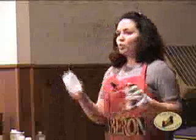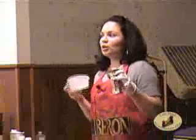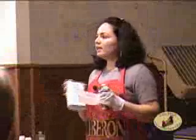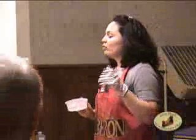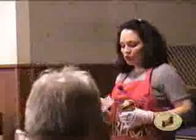What I have here, which is what this article is about, is a product called finishing oil. This is the one thing I'm going to mention straight about later on: there's pure tung oil, and that's all fine, and all tung oil is a 24-hour dry time. This product is tung oil with a resin dryer. So your dry time here is 4 hours, as opposed to 24, which is attractive if you're in a finishing rush.